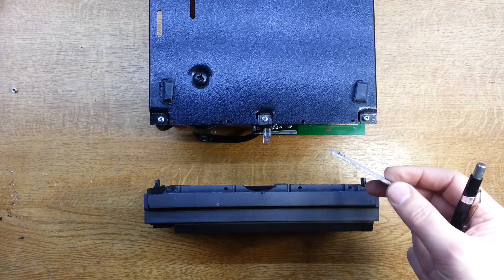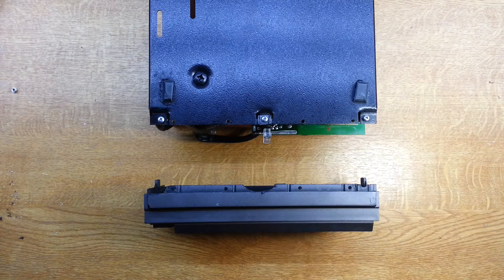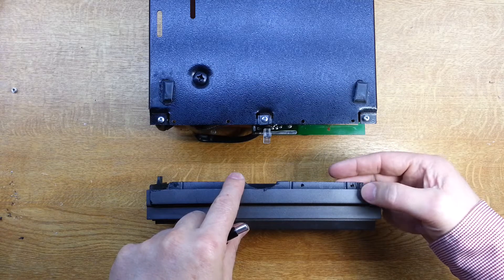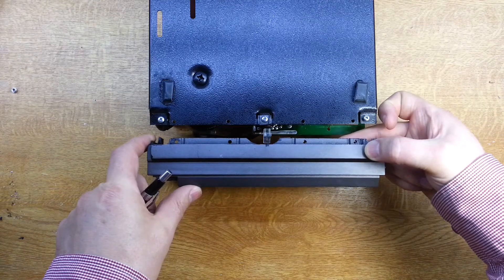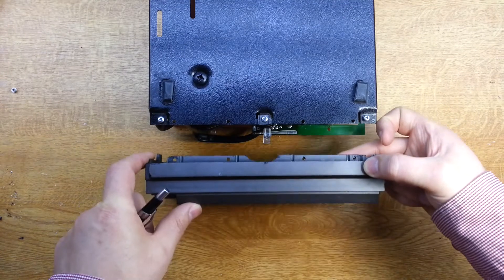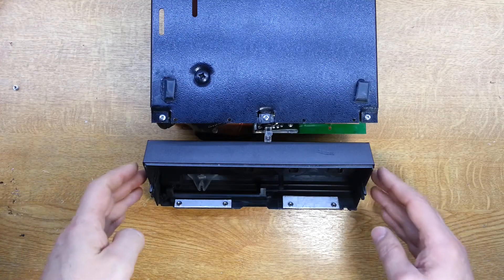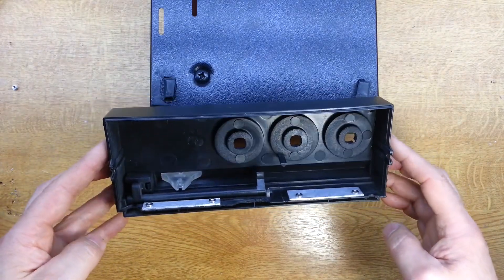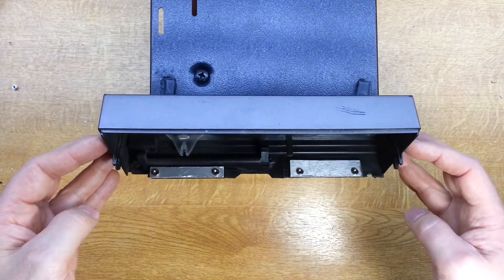I made these little aluminium plates and I'm using these self-clenching nuts — I've always known these as PEMs, but I think PEM is just one of the manufacturers. The idea is I'm going to glue that under here, which should be very strong. By the time we get that one here and the screws through there, that should be quite robust. I've glued these plates on now, so we'll give that a dry and then get that screwed together.